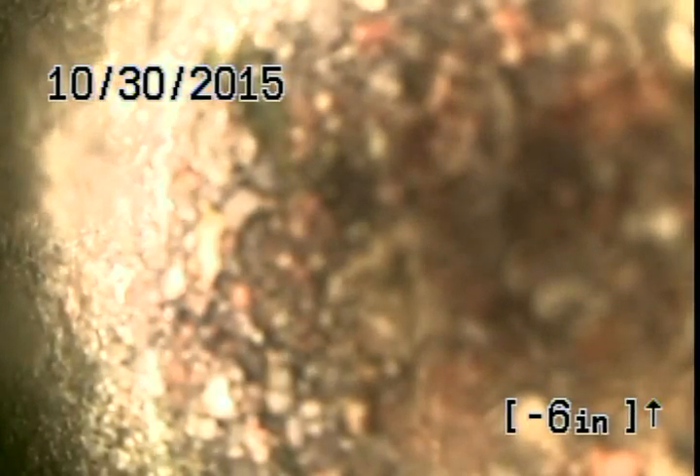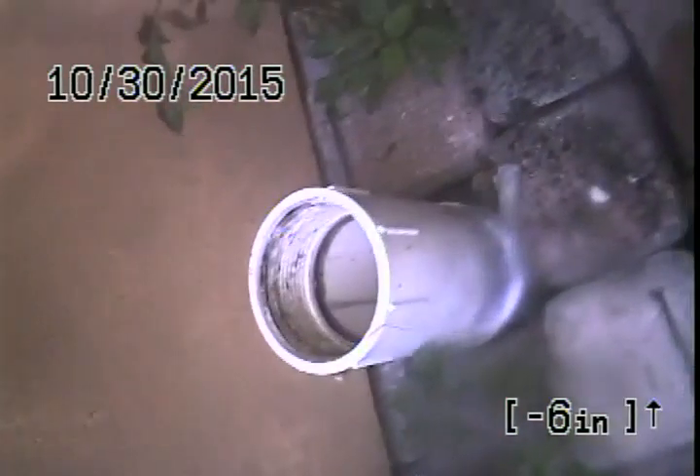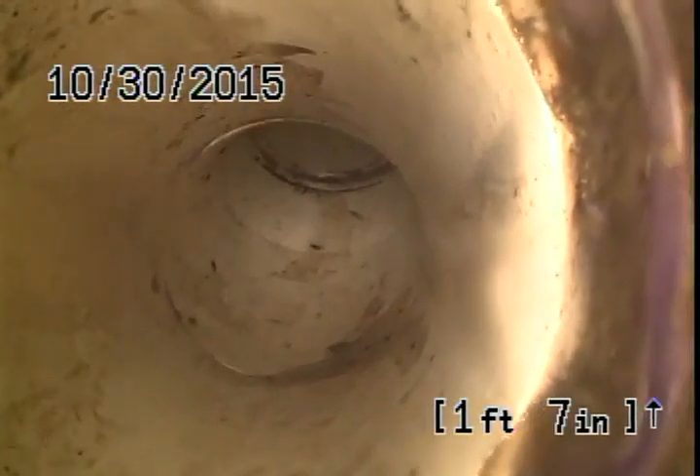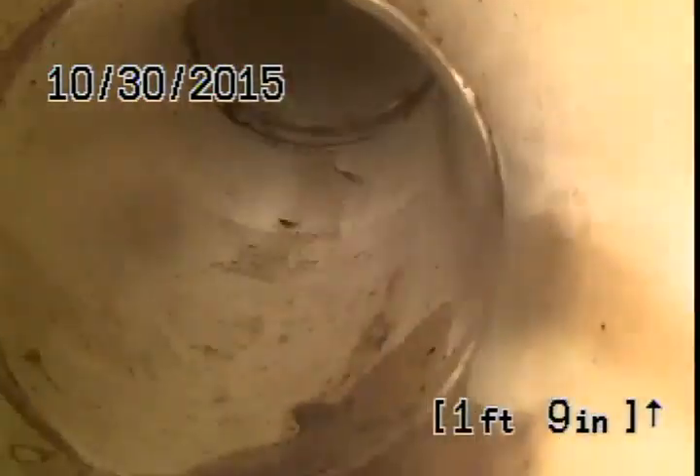3137 Bay Lane, waypoint home. We're in the backyard at a three-inch cleanout — there are actually two of them. The bathroom for the garage, over on the far right of the house, exits on its own. This is a septic house. There's the raised septic tank. Upon arrival, the water was off and we've had to glue a little bit of CPVC out in the yard, so we haven't been able to fire the water up yet. To check the drainage, I'm going to go up into the house from this cleanout first.